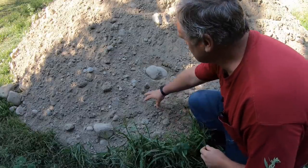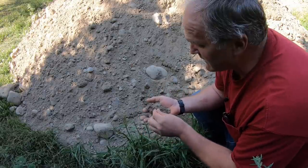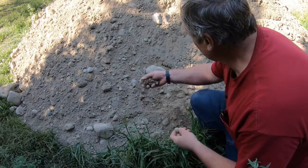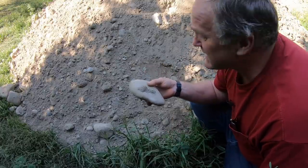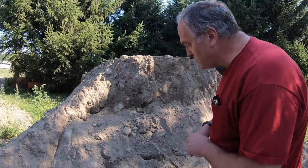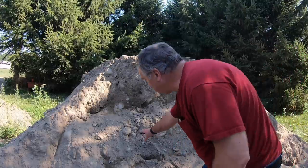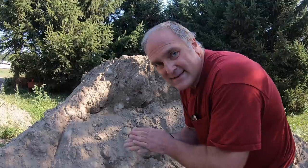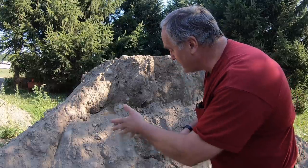What I settled on in the end is bank-run gravel. Bank-run gravel is just what the name says — it's material taken out of old river and creek banks. It's a nice mixture of silt on the finer end, moving up to sand, then small pieces of gravel, all the way up to large pieces of gravel which run five or six inches in diameter sometimes. Bank-run gravel is really cheap in this area, which is a definite plus. If I pick some up with the manure spreader and spread it in the fields, it's not a lot of money out the window. The issue with bank-run gravel is it's really squishy until it's compacted, so you have to put it in lifts or layers and compact each lift to get it to stay hard. Once compacted, it is really hard — the cows won't punch through it.